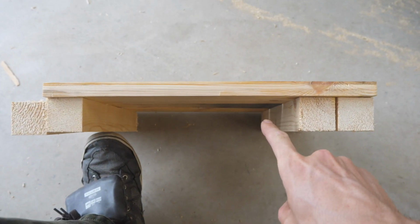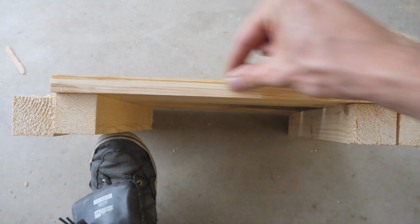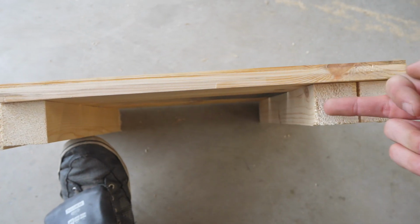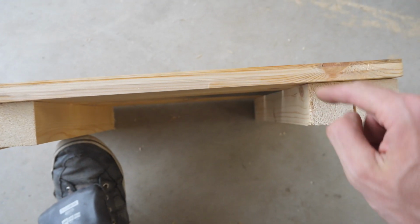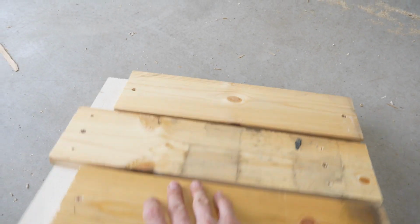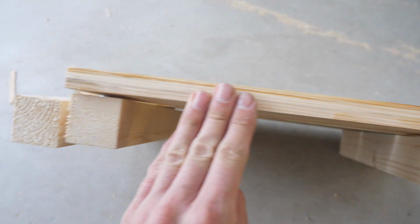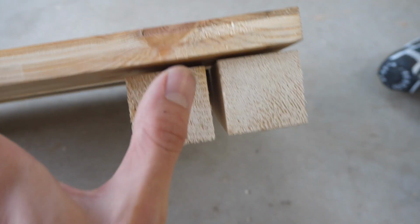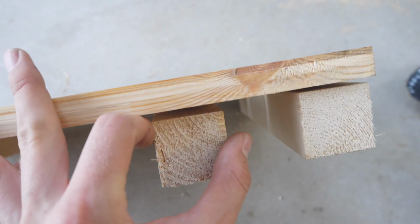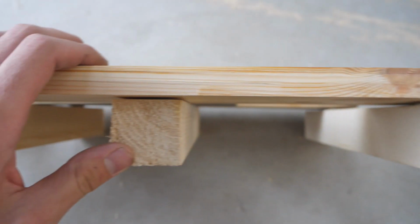Another problem that people come across when they first build a slat bed is that they screw it down just like this without any spacing on the two fixed bars. And this bar, the one that slides out with the slat bed, is meant to slide along there. This just rubs on here and it makes it impossible to pull this part out. I've now used some washers to space it out, and you can understand what I mean, in that when they're spaced out, this piece, which is part of the sliding out part, can actually slide out. I'm doing that with my thumb, so you need that little bit of gap there to allow this to move.